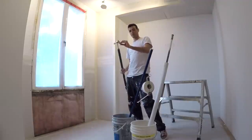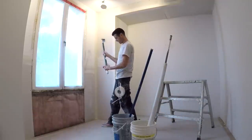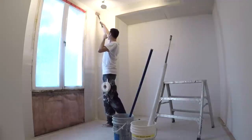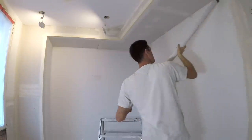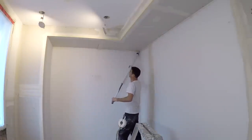When doing it this way, I like the three inch because I need a wider head to actually make sure I do a good job with all that mud there. I'm going to start at the bottom — oh, nine-foot ceilings, let's get a little extra length. That wasn't actually that bad for a first pass. I'm going to go one more down and we'll take a look. It actually leaves a really nicely feathered edge — there's virtually no edge there. It even puts a little bit of mud over top of the tape, which is what you want. You don't want to just wipe the mud out and have a cleanly feathered edge — you actually want mud over top of the tape because it's like a first coat. And it leaves a mess in the corners; we'll get to those in a minute.